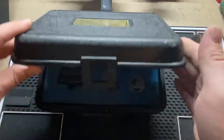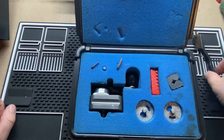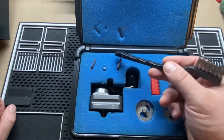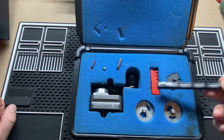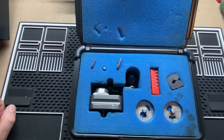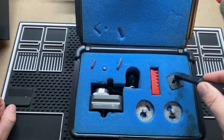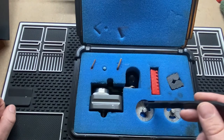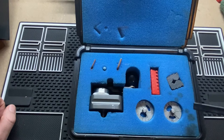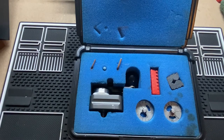So, what's in the box? As a quick breakdown: we have our adjustment allen tools, a spare cutter that's never been used, a tubular key decoder — this is the first generation; the secondary generation is blue, like this. Then we have this piece of rubber, which is used as a hand shield to prevent your hand from digging into the key. This piece is for offset keys and other pin orientations for different styles of tubular key.